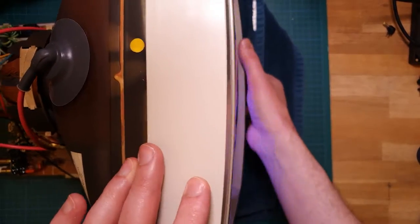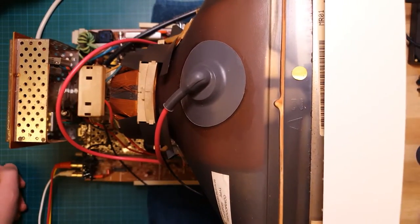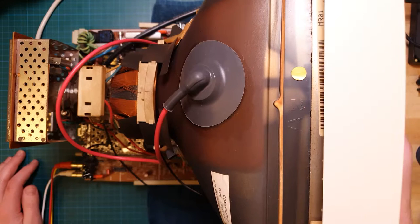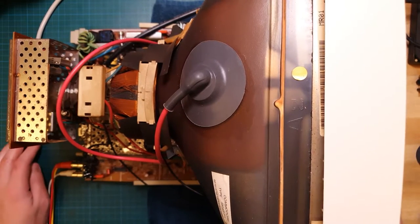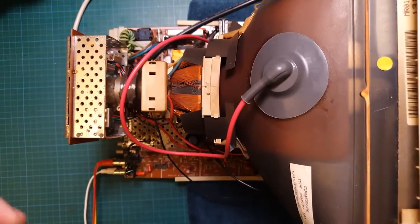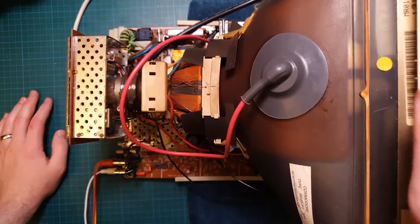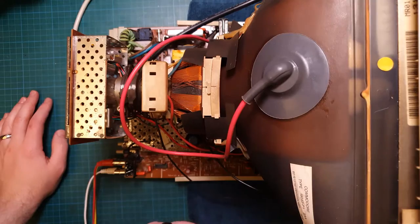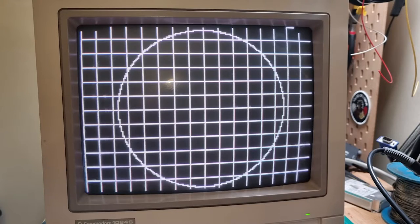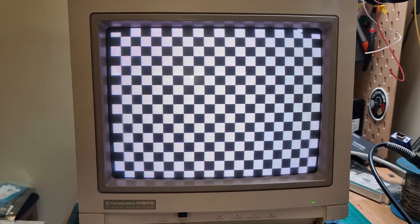So now all I have to do is just tweak all of the different calibration pots. So the blue, green drive, the red colors, the tilts and the phases and all the different adjustment pots to get this picture perfect. But I'm going to use the test build program, which is available on the website. I'll link it in the description, which allows the Commodore to actually output crosshatch patterns and color bars and things like that. And I'll probably just be flashing up a bunch of images of the outputs after I've done that. And yeah, this should be the completed monitor.